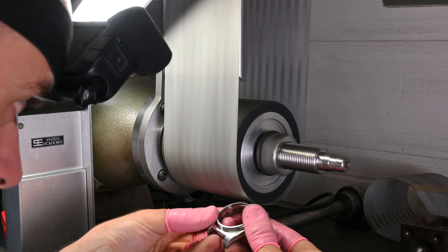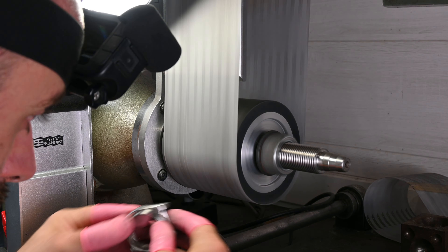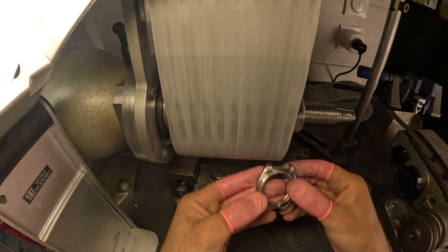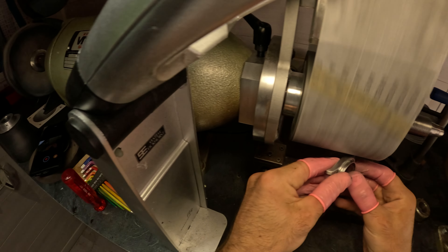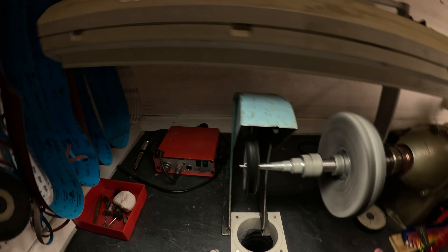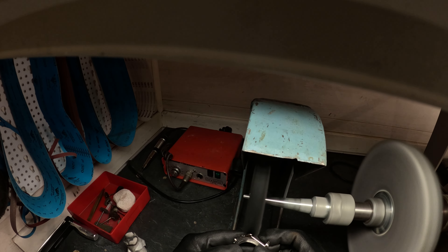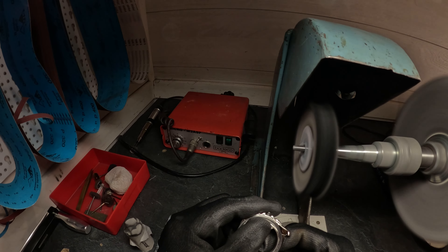I use a lot of modified older machines, especially this one. A friend of mine made this accessory for my machine — a big hello to him if he's watching. It's like a piece of sandpaper that I use with a specific grain dedicated to polishing watches. You don't want to polish a watch with 80-grit paper meant for wood. Then I move on to the polish, which itself happens in several steps using different polishing compounds, more or less abrasive, depending on the result we want.